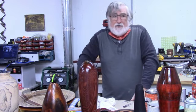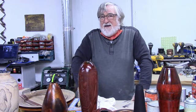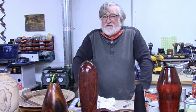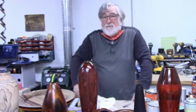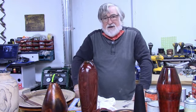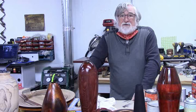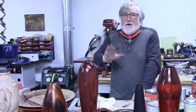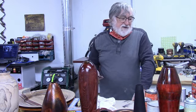For example, the leather dyes that I'll show you in a minute are alcohol-based. If you use a finish, a sealer that has alcohol as its solvent, then that sealer is going to lift the colors that you've got and start muddling them around and doing on your finished vessel what we've been doing on purpose with the sponges. So you got to be careful. If you're going to do that, start with a very, very light coat of the sealer and then just add it layer by layer, kind of dabbing it on, not spreading it around so that it soaks in but doesn't start smearing.